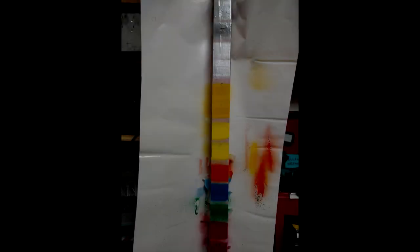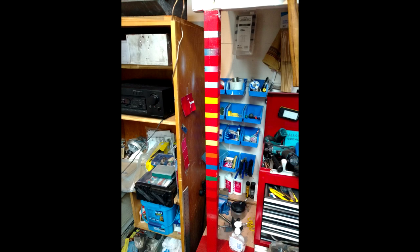So I was doing all these extra colors and I decided I should probably test all of them first. I painted a post that was on my workbench with the red, gave it a light sand, then masked off a bunch of different areas and tested a bunch of different colors of paint just to make sure I wasn't going to get a reaction. Whenever you're working with different brands and types of paint, you want to do this just to make sure you're not going to get reactions because it'll screw you all up. As you can see in this shot, it's a good thing I did — two yellows reacted really poorly with that red paint, got all wrinkly and crinkly — but I did find a yellow that worked with it.